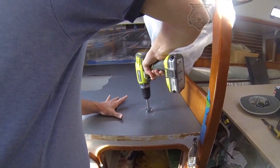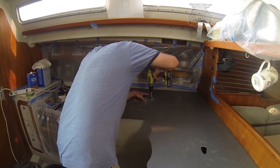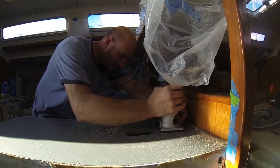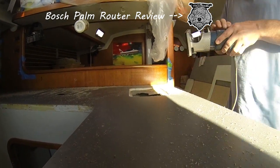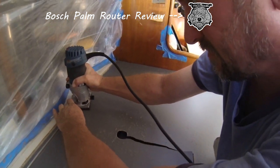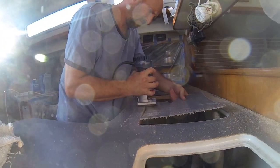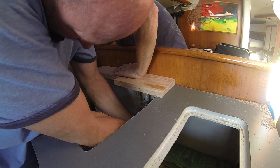Before you put the glue down or put your countertop down, one thing to keep in mind is make sure that you do all your sanding to make all your levels level. Once I've got my countertop glued down, now it's ready to route. So I drilled my holes — those were just starter holes for my router — and then I put the router in and just go around my edges. You want to be very careful because some of these edges are actually beveled, so you need to make sure you have the perfect bit for the bevel. Then I just go back and double trim my edges, which knocks off any of that extra cardboard from the laminate.